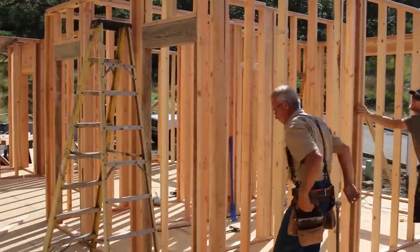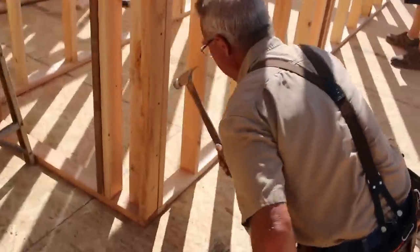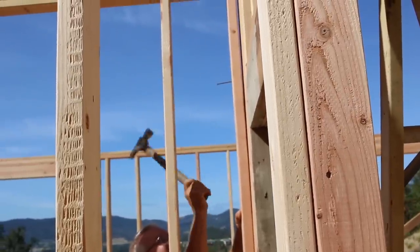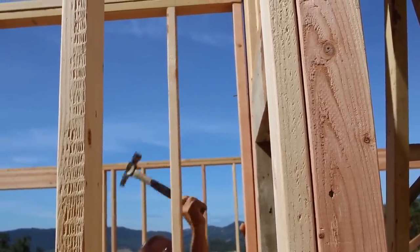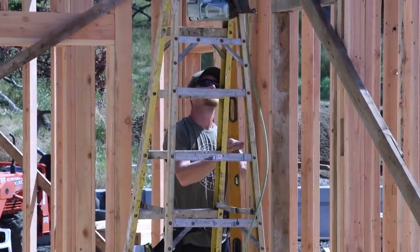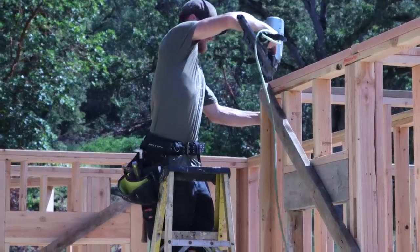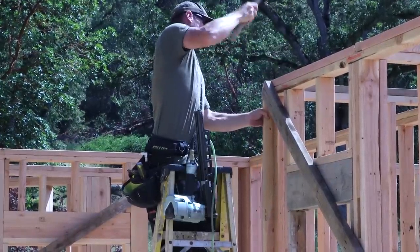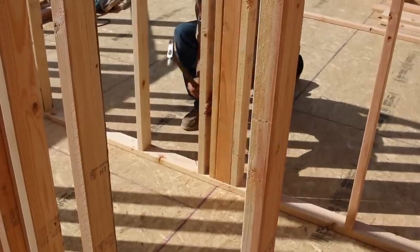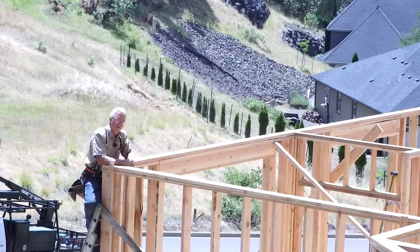You can think of it as a little insurance work, because when we get up and start building the floor system on the top, we don't want to have to think even once about whether or not the crown plates that we're nailing to are actually in the right spot. We want to be certain that everything that happens moving upward from here will be right because everything that was below it was right. So the primary importance of this crown plate is to lock all the walls together.